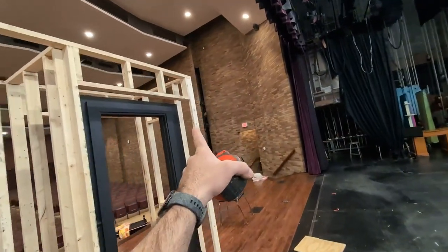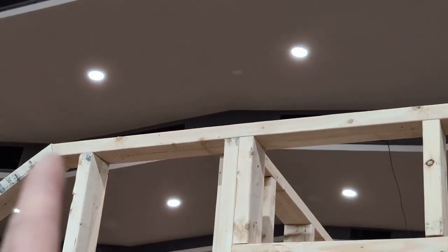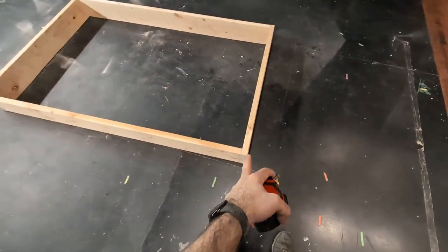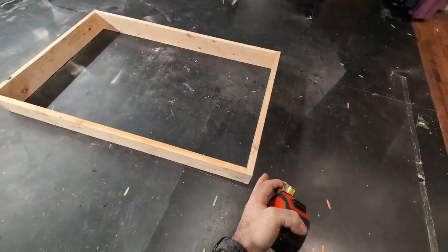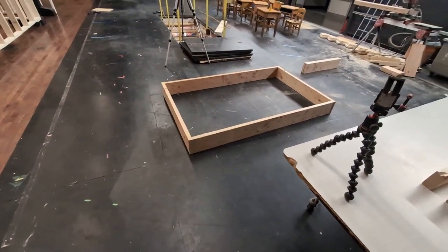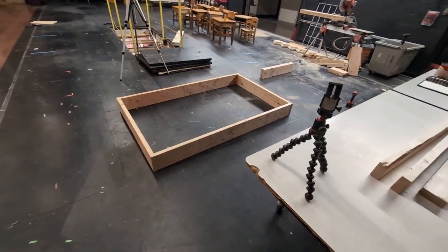I added this wall to the design. So by design, from the point up there, from that point across the top is 72 inches to there. Then I wanted the landing to sit on top of this wall, so I added 3.5 inches. Then I took 3 back off to account for the 1.5 inch here and the 1.5 inch there, so that this thing is now correctly the right length. But the end grain will show as you look at the side of it. Even if we paint it, there'll be a little seam. It starts to become like, who cares? But I want to keep track of that type of thing because the more practice I do here, the better off I am overall.